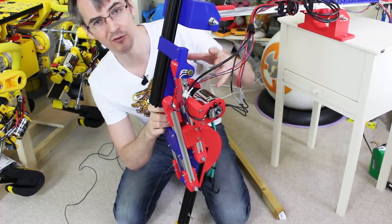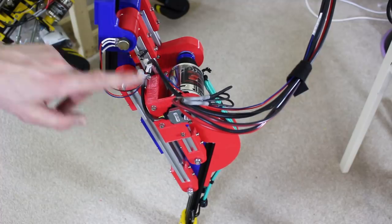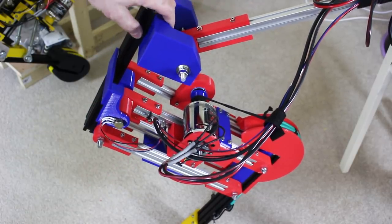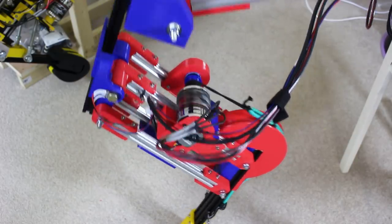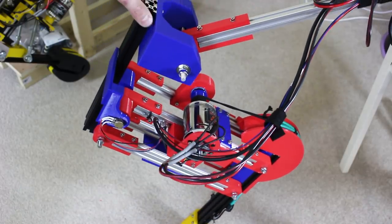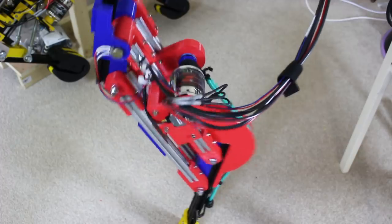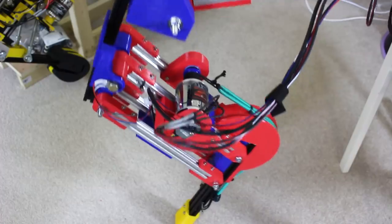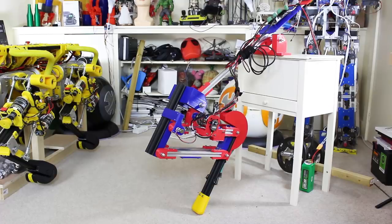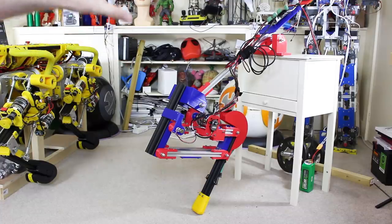What I've done now is use the pot position so that the motor tracks the pot position. If I push on here you can see the motor unwinding - the motor still has holding power, so if I let go it should stay there. Basically you can see that motor tracking the actual leg position. We've scaled the pot and made the motor track it - there's no fancy PID controller but we could get a better response. Essentially it's now compliant, which is quite good for absorbing a load. In normal mode the motor doesn't comply - it back-drives a little bit but most of it is the springy leg. This is very useful because we can use compliance to absorb load when we jump. We'll make the leg jump and as soon as it's jumped put it into compliant mode to absorb the landing load.